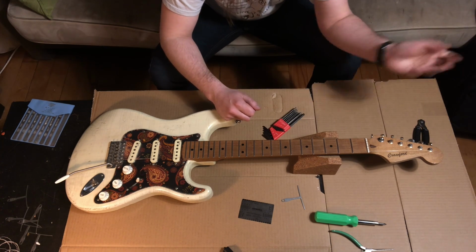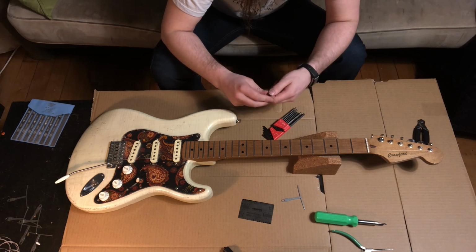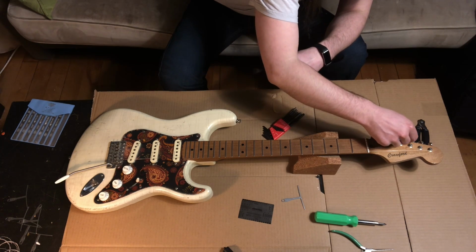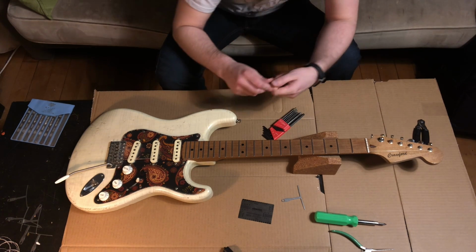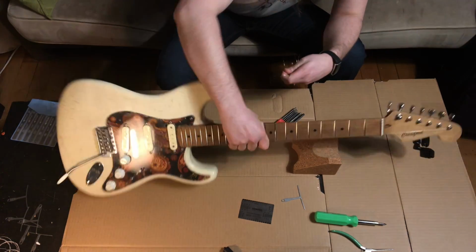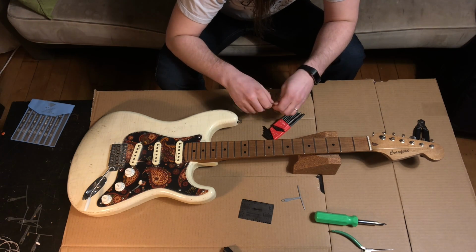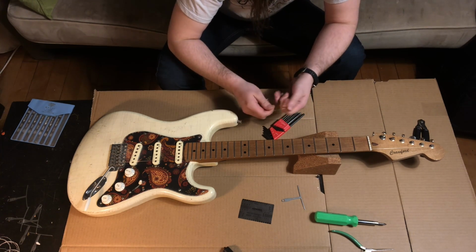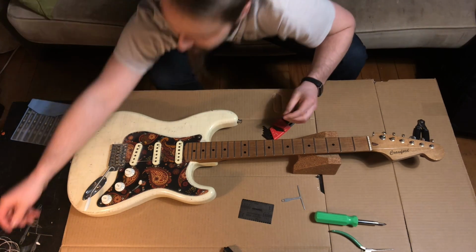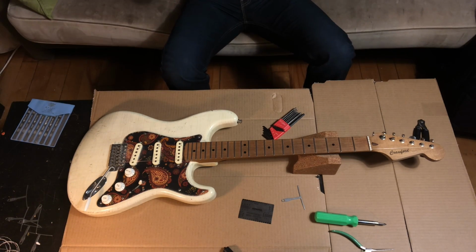And so I just broke it off all the way and glued it back with Titebond. I was only missing a little bit of wood here, so I had to fill that once the glue dried. Once it dried, I put a bit of finish on and buffed it out. I'm pretty happy with it. It doesn't look awesome, but I don't need it to look awesome. I just need it to look credible, whatever that means.